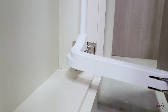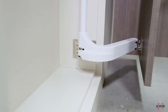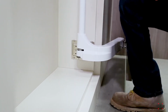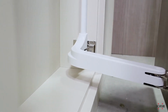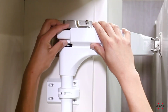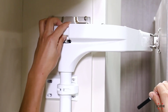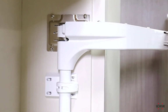Once installed, test the door opening and closing speed. If the door closes too slowly, open the door to access and remove the damper holder. Remove the plungers, reinsert the damper holder until you reach the desired speed. If the door is too light, you can decrease the damper force to achieve desired closing speed by removing additional plungers. Ensure that the dampers are inserted with the small pegs facing towards the damper holder.